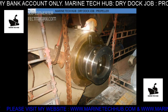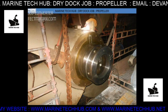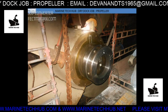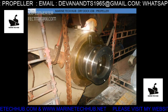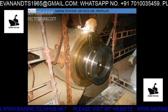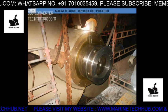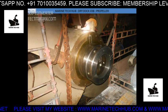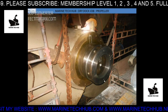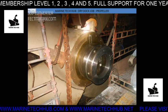This is the hydraulic nut. In the dry dock, we put the hydraulic connection in the hydraulic nut here. I will show you where the connections are put. Once that is pushed, we turn this out — you can see the rod put here for turning. Normally we turn it so that the nut comes out. When you are turning it, you have to apply hydraulic pressure here. The nut is then removed.